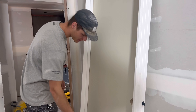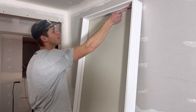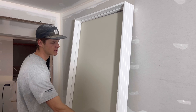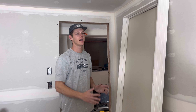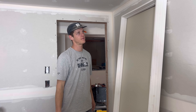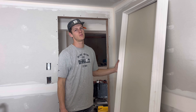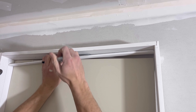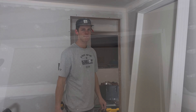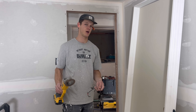Normally I'll mark the outside of the door stops — not to put them back in the same spot, but just so you can tell where you want your nails to go. That way you can hide them with the stops after, and it makes a lot less work for the painter. So we're going to pull these off. All the stops had staples in them, and the easiest way is just to grind them off real quick.